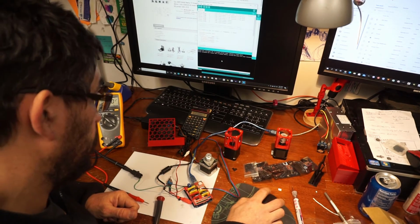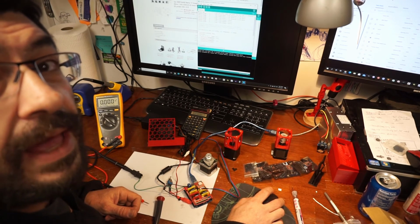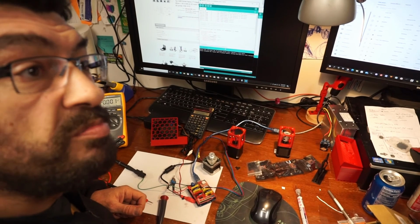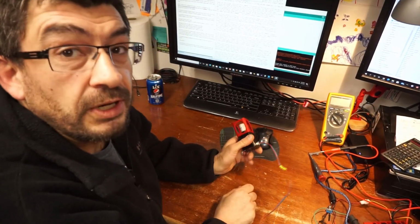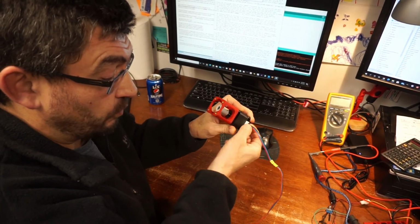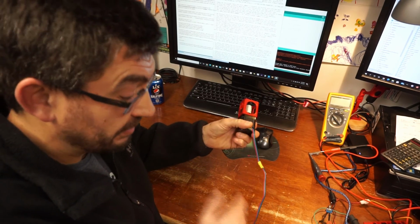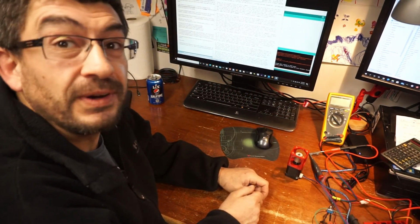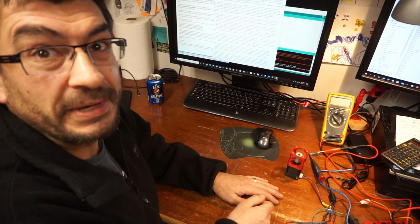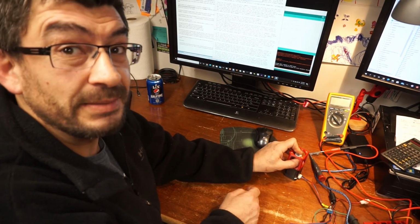Imagine that, it works. Okay. So, yeah, the CNC supply shop in China sent me bum steppers. So I saw a review for a product that said that their motor wasn't working, and they switched the two inner wires, and all of a sudden, the motor was working. So I tried it, and it worked, and now everything is great. So, yeah, I was troubleshooting for 4 days pretty intensely, trying everything, returning equipment and replacing it, and it was just that the motor wires needed to be swapped.